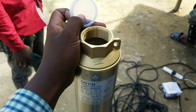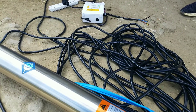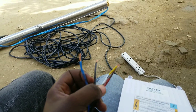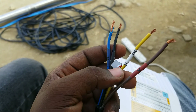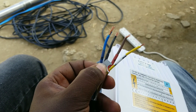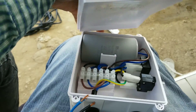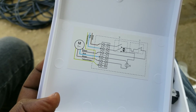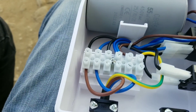There is an upper cover that you're supposed to remove. Instead of having three wires, you can see that there are four wires coming from the water pump. These wires are labeled A, E, C, and M, and they also have different colors. You can see the E wire and the A wire is a brown wire. These color codes can also be seen at the back of our control box, which has a circuit diagram to help you figure out how to connect these wires together.